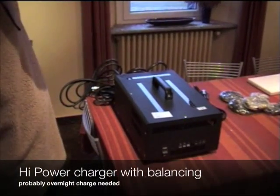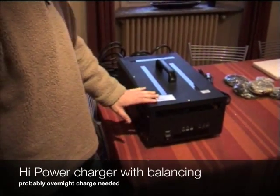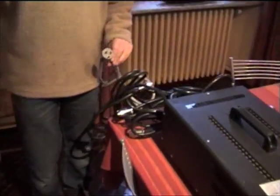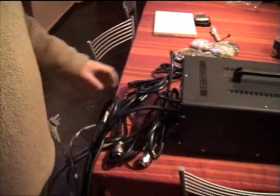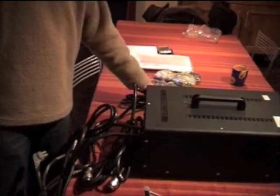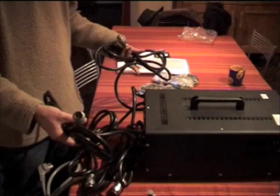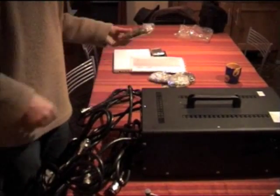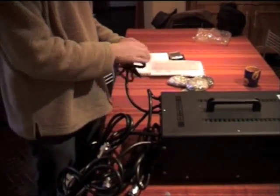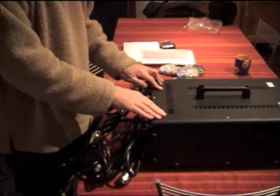This is the High Power charger. Looks like they've custom built it because it's designed for 100 cells — a nominal 300 volt pack. It's 240/220 AC input, which goes into this plug here — we assume it's the one they use in China, so I'll have to cut that off and fit another one. There are some instructions in Chinese but I've got the English version on the computer. Basically there are five balancing — equalization output circuits to be attached, with harnesses that go on top of each battery, spread across the 100 cells. When it's charging, it's going to charge in a completely balanced way.